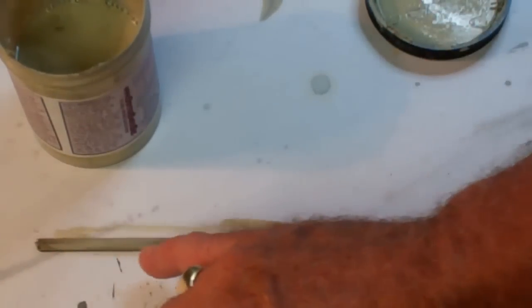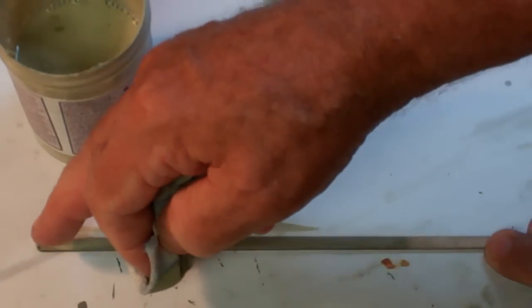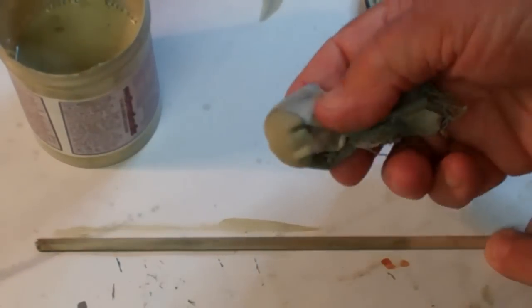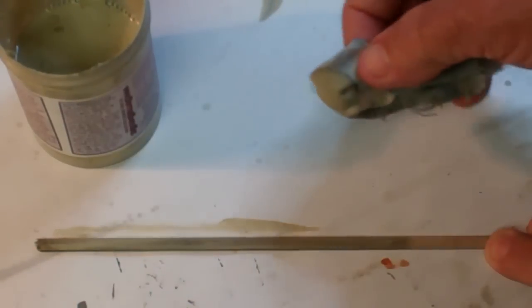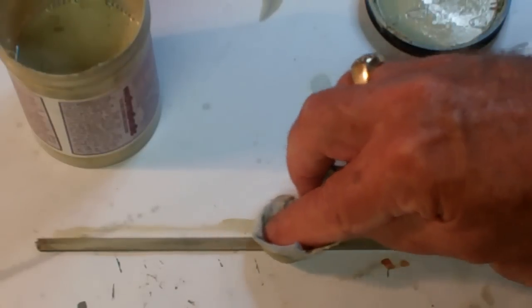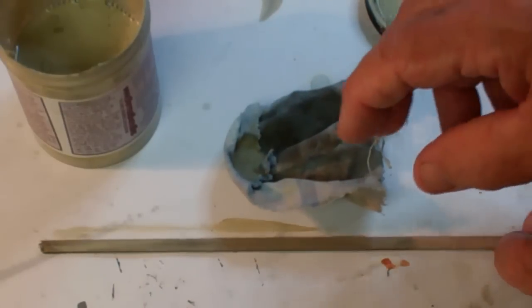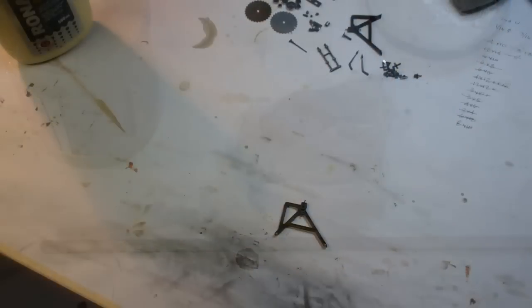It'll vary the texture, but what it's doing is depositing a gray film on the surface. If you don't apply it lightly — if it soaks in too much — it ruins the grain. Done correctly, it leaves a nice finish akin to driftwood. I let that dry and then do the same thing again with the steel wool, just very lightly taking it off, because it also has a bit of a water base in it.